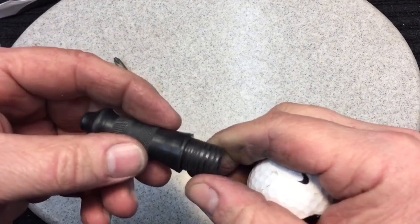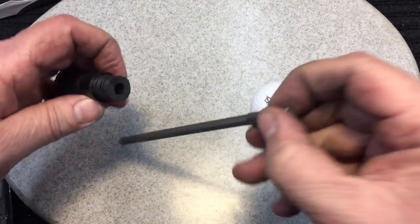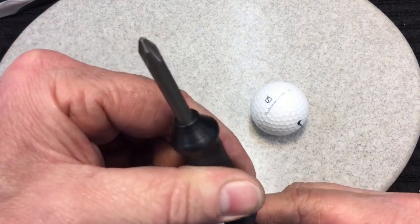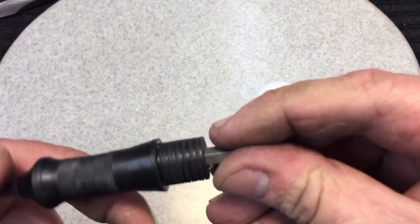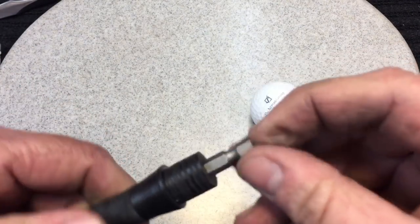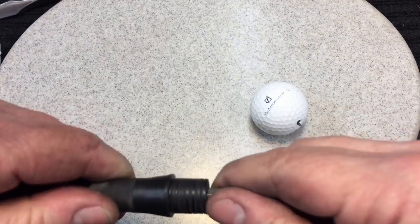Okay, here's our pre-assembly stage, and you can see here we have everything done up more or less. And now what we're going to do is we're going to JB weld everything. We're going to pass this through here. You see it tightens up as we get it through the tip here. This will be pressed into there. Pressed in. You don't need a lot of pressure, but we can press in with the JB weld. It will be all in there.